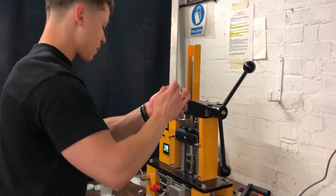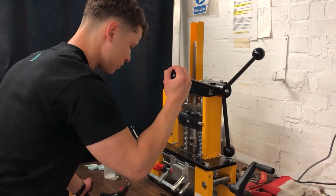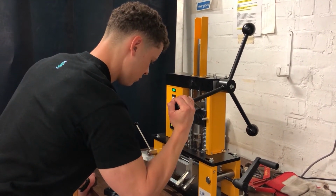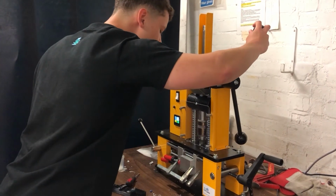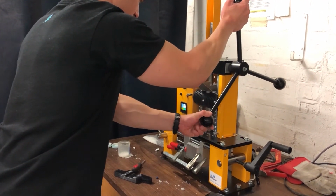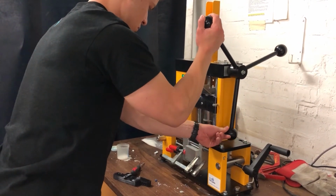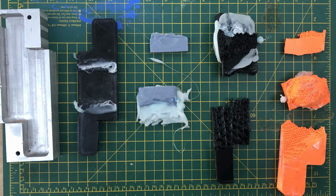The largest technical difficulty faced throughout the project was experimenting with different 3D printed materials for the mould and finding the correct temperature for the moulder that would result in a repeatable process that produced good quality parts. I experimented with different combinations of ABS, PETG, PLA and resin for the mould material, PLA, ABS and polymorph pellets for the injected polymer, and temperatures ranging between 160 and 200 degrees for the injection temperature on a C.R. Clarke injection moulder. This experimentation took 6 iterations to achieve a successful injection.